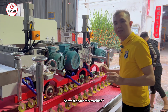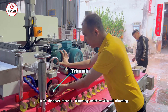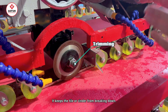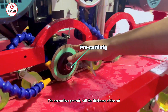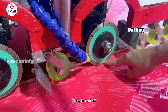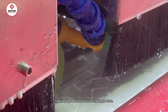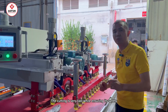This machine is composed of three cutting heads. The first part is a trimming function, which we also call foot care. The function of trimming is to break the glaze, which makes the tile or sintered stone not crack. The second is a pre-cut, cutting half of the thickness. The third is to cut exactly. So this combination method ensures the cut tiles or sintered stones will not produce cracking or chipping, and it's very fast.